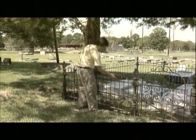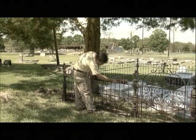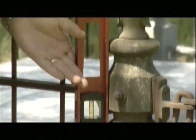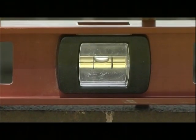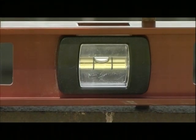Okay, let's get started checking to see if the fence panels and posts are straight and level. If they are not, you may want to lift or lower the corner post. This is only important if the panels are so far out of alignment that they are not fitting together correctly. In some cases, posts may be set in stone or concrete. If the base of the post is too heavy or large to dig around, then it should be left alone. Otherwise, the base of the post will need to be exposed and lifted to the desired height. Gravel or dirt can be placed under the base to stabilize it at the needed level.